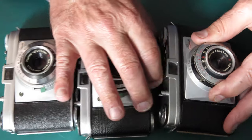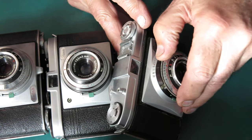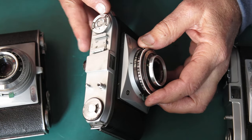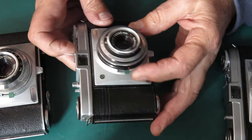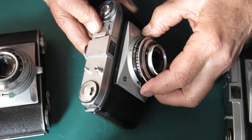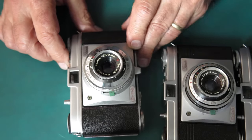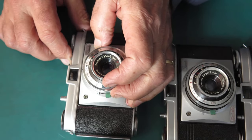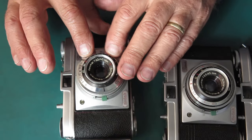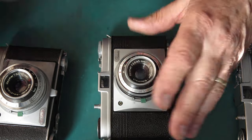The shutters started off fairly simple. These are simple shutters, separate aperture and shutter speed controls. Here in mid-range production, we have an EV system, so you can set the EV value and then the aperture and the shutter speed move together. And in the later production, we have the EV value here again. It's probably a bit of a tidier system, and the most noticeable feature here is we have a lot more chrome on the shutter. These pieces were nickel plated,